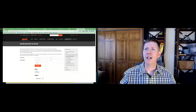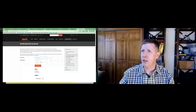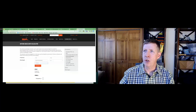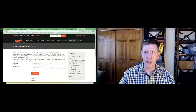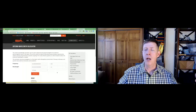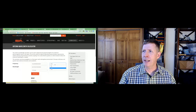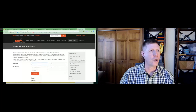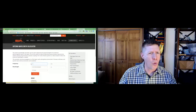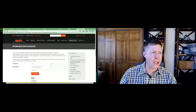Don't worry about that. There's a calculator. You go to the calculator and you put in what your frequency is, say 100 megahertz, and you want a full wave antenna. You want an antenna that is 299, so let's say 300 centimeters or 3 meters, a 3 meter long antenna in order to capture radio waves at 100 megahertz. Okay. If we change and now we're in gigahertz, something like 2.4 gigahertz, which is what Bluetooth and older Wi-Fi and Zigbee and a bunch of things use, then that full wave is 12 centimeters.